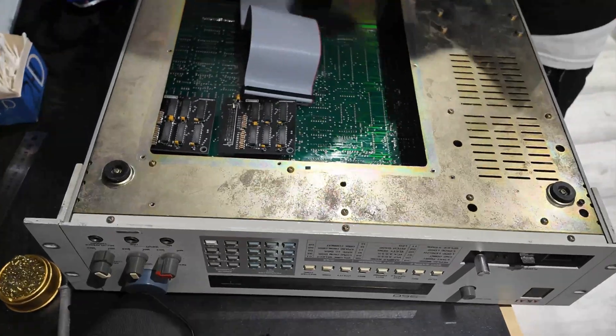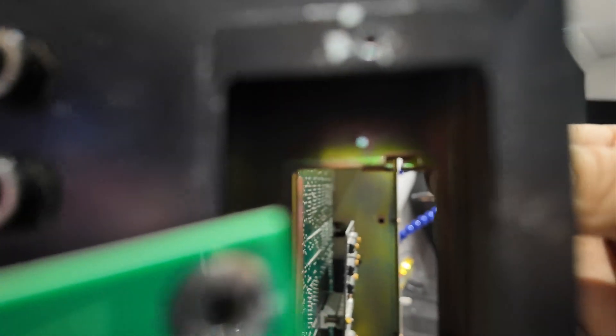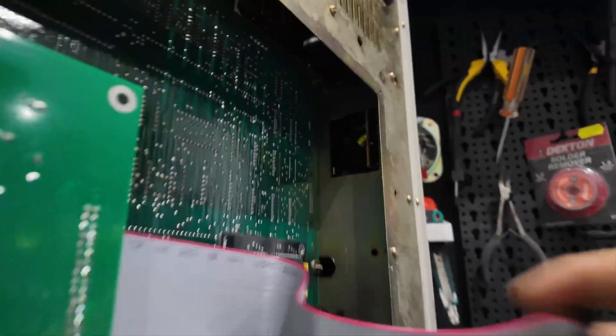Once you've upgraded your ROMs, you then have to open up the bottom of the Akai. There's a little trap door at the bottom — you open up that trap door and there are a couple of guide rails that you have to literally slide it in and connect the cables. Once that's all done you're all up and running. I've made a full video on the journey of setting this up for those of you who want to geek out.